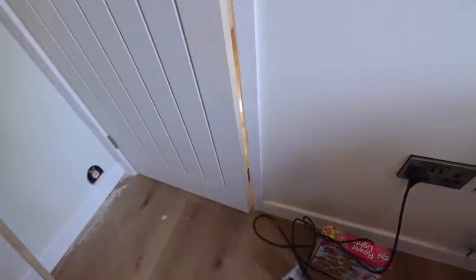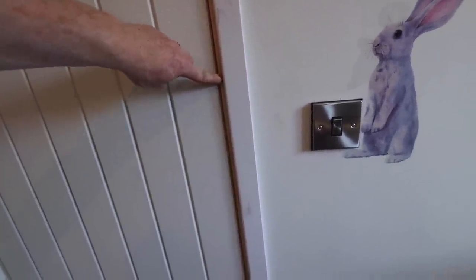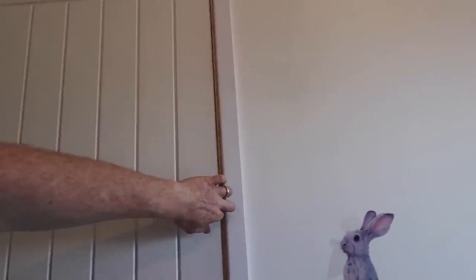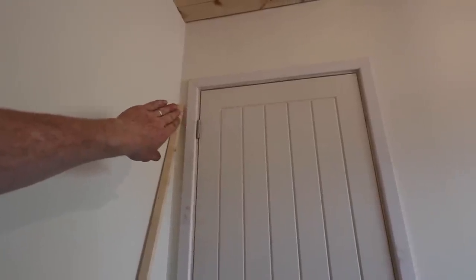We're good there — don't think it needs anything planed off that leading edge. Gap at the top is still a little bit more than I'd like, but I think that's more to do with the lining being a little bit off than anything. Once the door stops are all in, that should look just fine. Might find that once those two last screws are in, it'll pull it across a little bit more, which will sort that out.